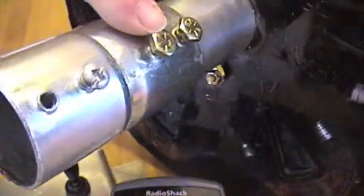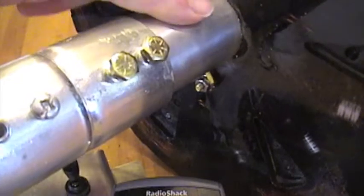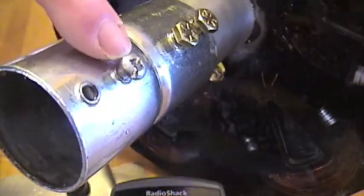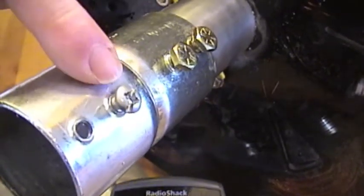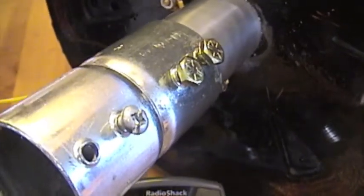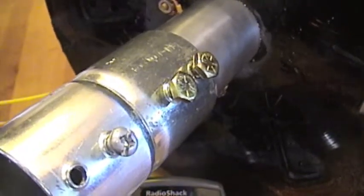This is the pole coupler — it's for a one and a half inch EMT pipe. These two bolts are deeply set into the aluminum hub, which is off the Gull 160. For the 175, this will probably go to two inches — haven't got those machined yet. I recommend putting through bolts: remove the set screws from the coupler, drill all the way through both pipes, put two through bolts through and tighten. That'll cinch it down on the EMT and it'll be really tight and won't spin.